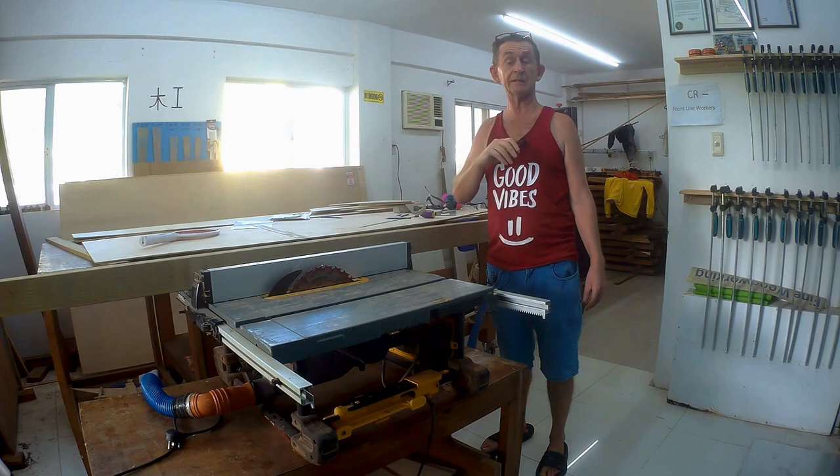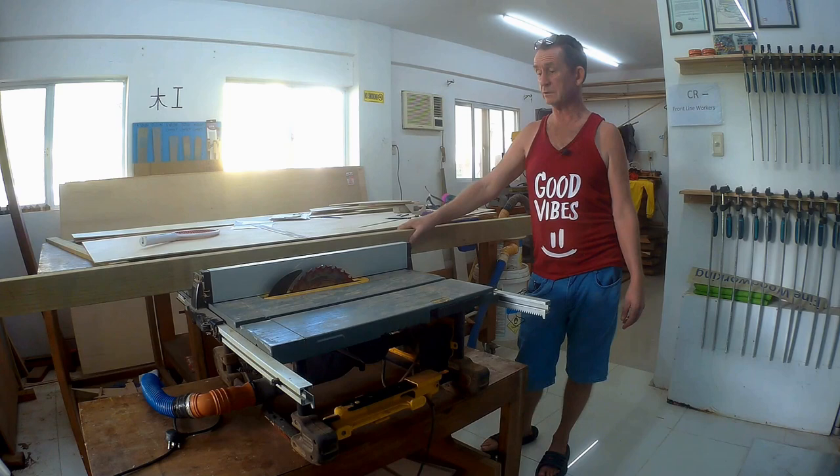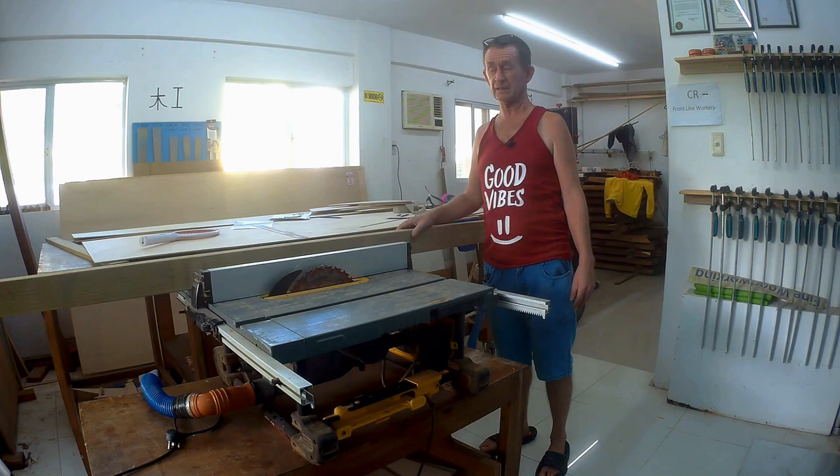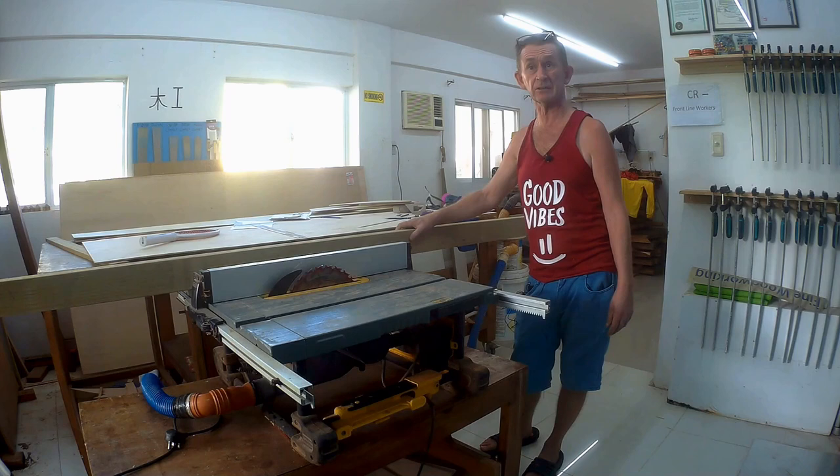So I got a 10 foot long piece. It's a little bit of a curve in it, but there's no knots in it, and it's treated. I'm not sure if that's such a good idea, treating it. So I'm going to cut mine up from this. Now, I have a workshop here and I have saws and all that. If you can source one by one or two by one and cut it in half, then it's fine. Now, when we say one by one, we're talking about finished size, which is approximately 20 millimeters.